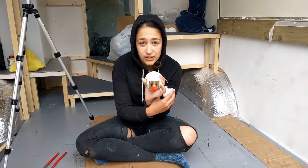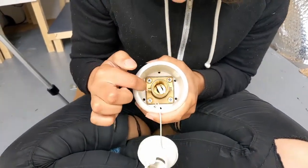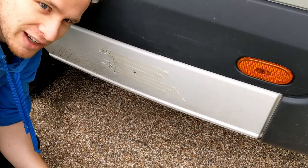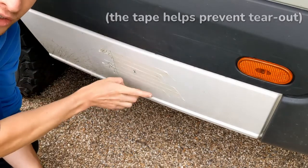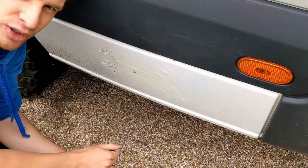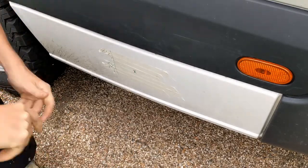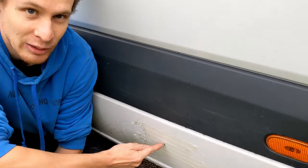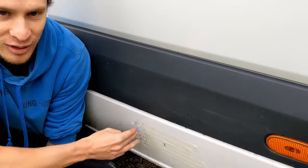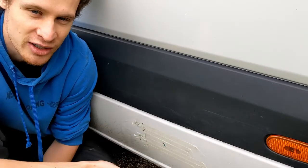We've assembled it now with the nuts tightened up on the back. It's worth noting that the cap should come out the bottom and the two pins should be facing side to side, not up and down. Now it's time to drill yet more holes in the van — a 70mm hole roughly here. On this side there's a chassis member, so we definitely want to avoid that, and being on the other side also means our filler hose will be somewhat protected from road debris kicked up by the tyre.